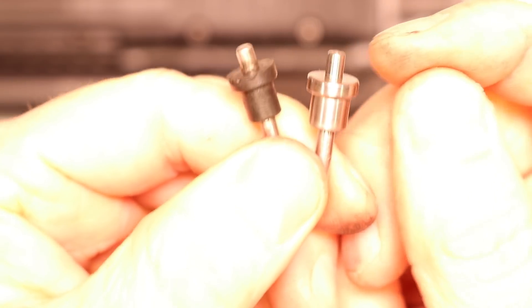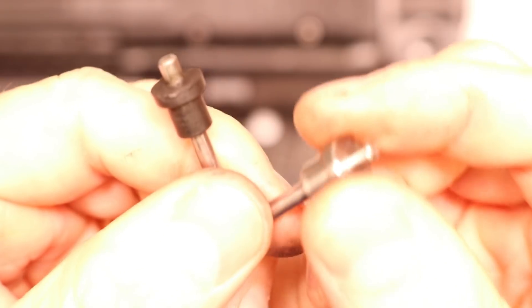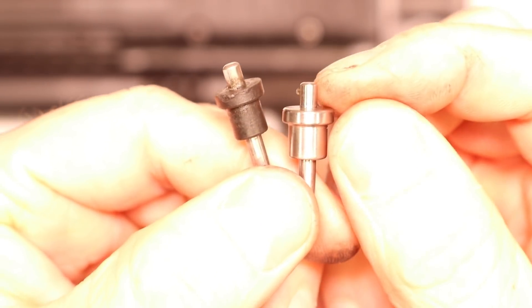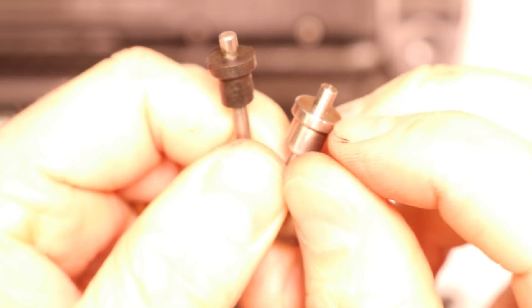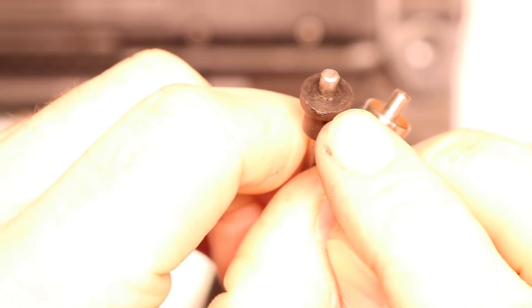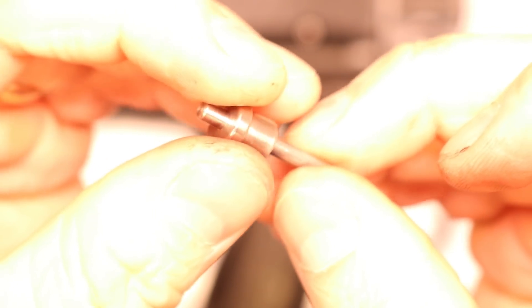Really excited about this 300-series stainless steel hammer bushing and pin. It really is the complete package to ensure we have that appropriate standoff at 175 thousandths, with the most premium material to prevent any sort of wear and galling like you see on the plastic one. We're still finishing up development but we should be able to roll into production pretty quickly.